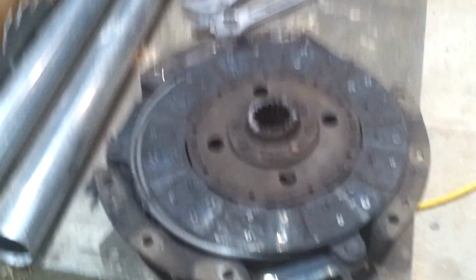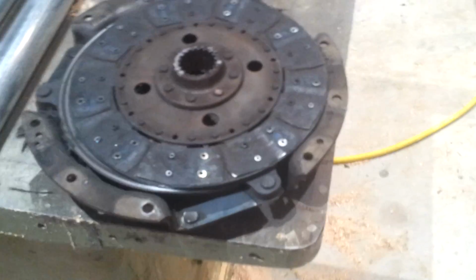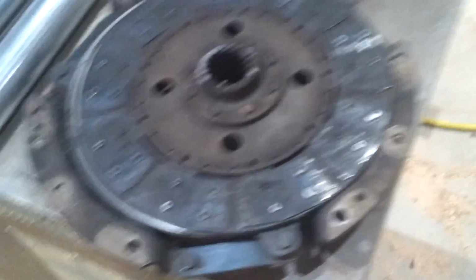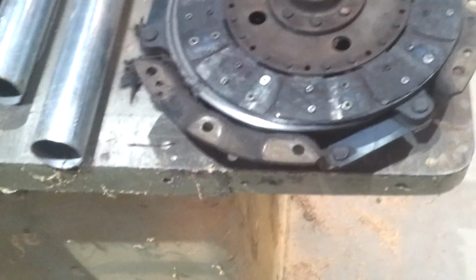You would think that those 4 would not hold as good, but the thinking behind them seems to work. The heavy-duty drag racing clutches and racing clutches, a lot of them don't have this full circle friction disc. It's just 4 pads, and some of them have 6. But it cost me $50 more.